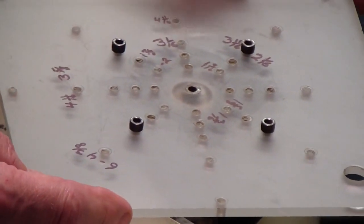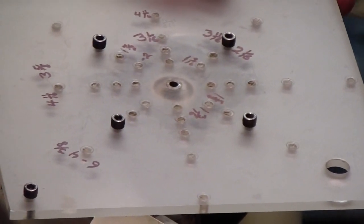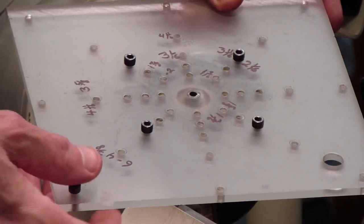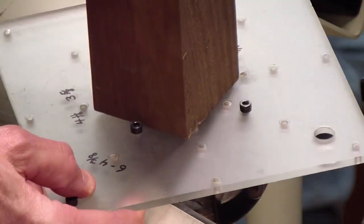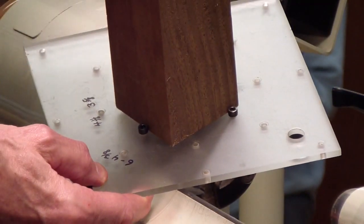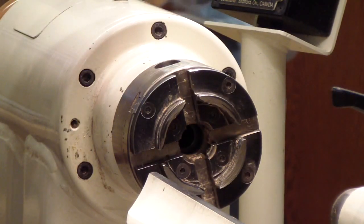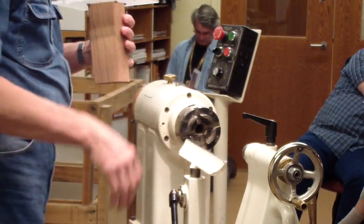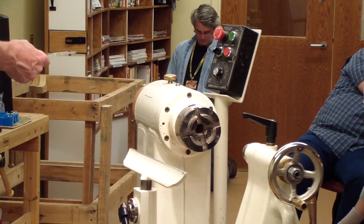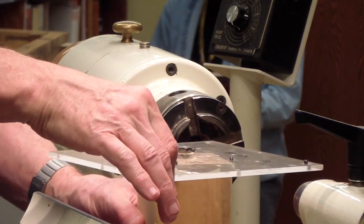This is what I use a lot. I just have a few pieces to drill a hole in the center, and there are these heads on these screws. These heads catch on the corner of my stock. I slip it on there and rotate it, and you can actually watch the stock raise up. And now it's centered.